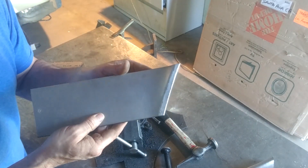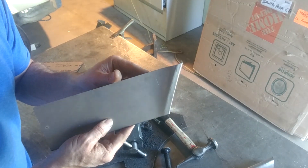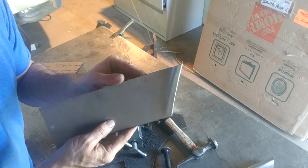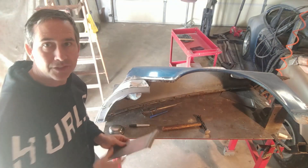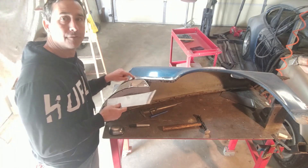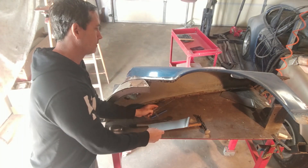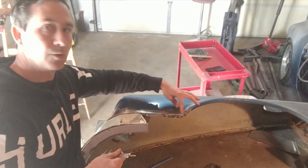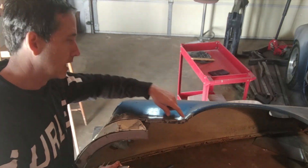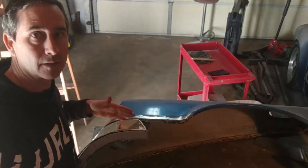Okay, now there's essentially no more hammer marks — this part is done. What I plan to do now is get ready to weld this piece onto the fender. I'm going to mark this edge and make a two-inch line above it, so after I cut it off I still have a reference as to where the straight line belongs.